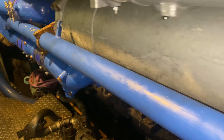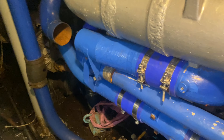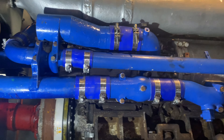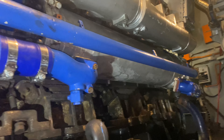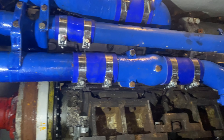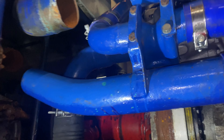On a railway locomotive everything is colour coded. In this case we're looking at the coolant pipe work, which is painted French blue. As you can see, there's quite a complex matrix of various pipes going off to different parts of the engine and also the ancillaries, including the heat exchanger, turbochargers and cooler group.